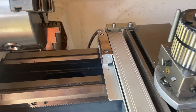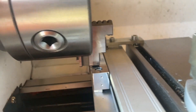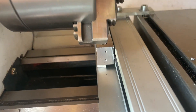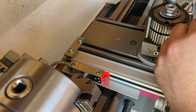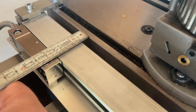Why am I moving my linear scale from the DRO on my lathe to the back side of the slide? At the moment, when I want to turn a part at a bigger diameter than about 60mm, the linear scale gets in the way. Theoretically, I could turn 240mm diameter parts on this lathe and I really want to have that capability. Because of that I am moving it to the back, even though I will have less reach with the tailstock. But I think that trade will be worth it for me.